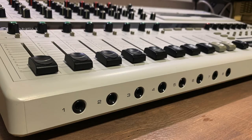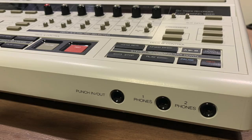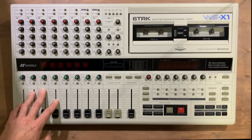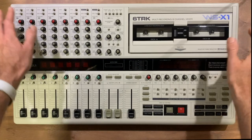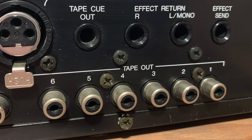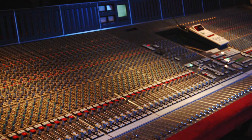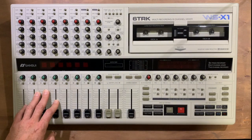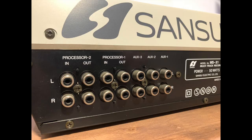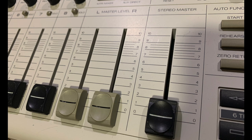The main channel inputs and headphones are handily placed on the front of the unit and everything else is around the back. This includes XLR inputs for channels 7 and 8, but sadly no phantom power. We also have 6 tape outs on phono sockets, which gives you access to a direct feed from the multi-track for utilising a more sophisticated mixdown. Alternatively they can be used as individual sends to outboard effects, and there are plenty of options in the returns department. Three stereo pairs of phono connectors marked auxiliary can feed either inputs 7 and 8 or access the mix bus directly.